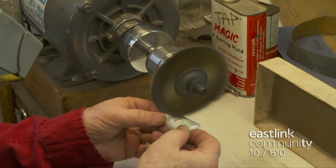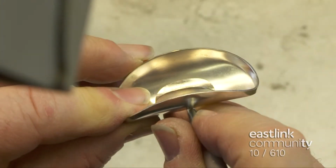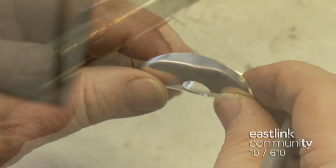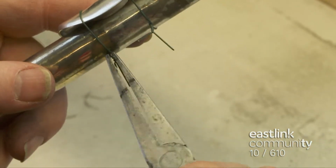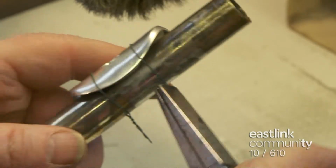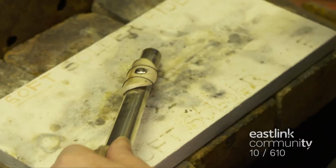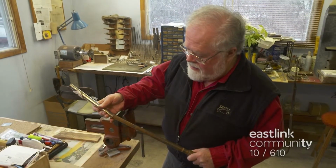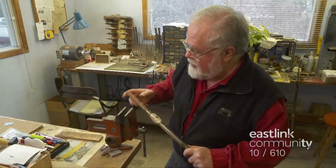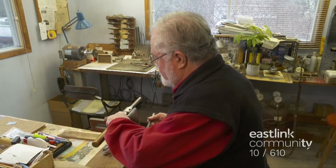Once the lip plate assembly is out of the pickle, it's wire brushed to remove the remainder of the discoloration. It's also inspected using a pick, checking for any gaps in the soldering. Coated wire attaches the lip assembly to a temporary working tube that will support the lip assembly while it's being shaped. This temporary attachment is soldered with a lower heat.